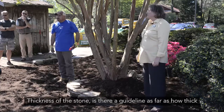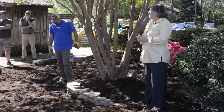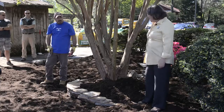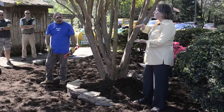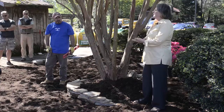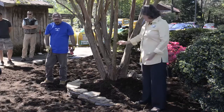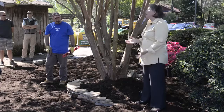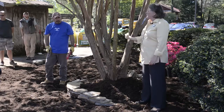Question: Is there a guideline as to how thick a stone you select should be? That's totally up to you. Thinner stones look better for low walls because you get more dimension to it. Thicker stones have more weight and are better for taller walls. But building with larger stone just to do an edging like this — design-wise it's not going to look right, you won't have as attractive a face on it.